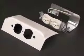A new and unique feature of the Designer Series is the use of downward-facing activations. The downward devices install a little differently. Wire the device and attach it to the downward-facing bracket, snap into the base, and once in position, tighten the two positioning screws.